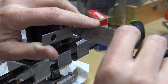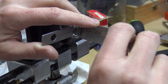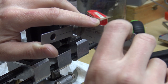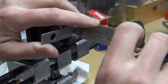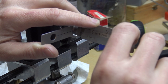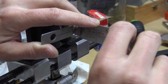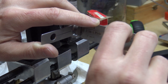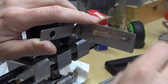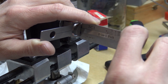Two springy, three springy, four springy. Back to five — five is what gave us our false sets. I would think that's the standard pin. Usually these Schlage deadbolts generally have four spools and one standard. Five is the standard here. Getting back to our false set, back to one.